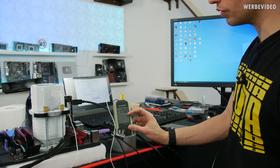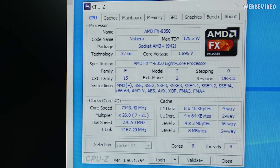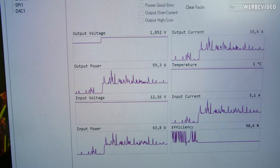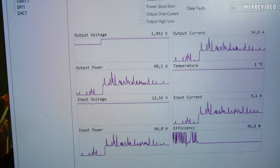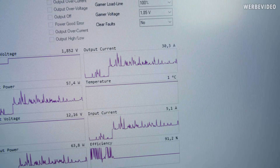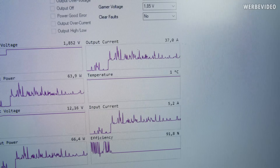I thought I could show you how it's not working, but now it's working even better. That's how easily we got to 7 GHz, currently running 1.9V on vCore — in Elmore EVC I set 1.85V. It's currently loading at about 50 to 70 watts, about 30 to 40 amps. VRM temperature cannot go lower than 1 degree Celsius in the readout.